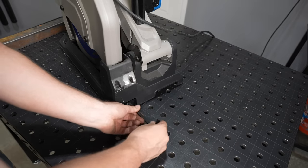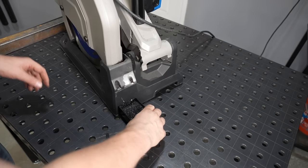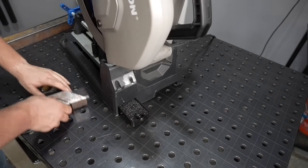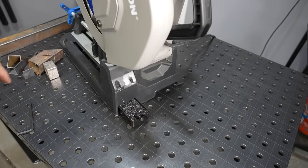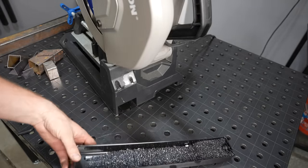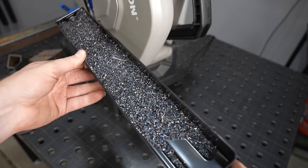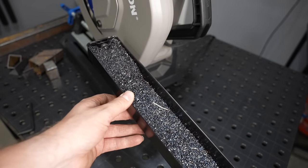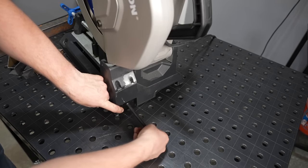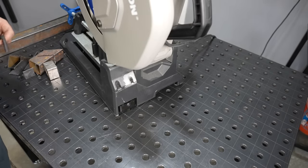Let me slide out that tray — I use the allen key to loosen the latch, and it's spring-loaded to pop out a little bit. I need to raise the blade up to get it the rest of the way. In my experience, this tray fills up really fast — you remove quite a bit of material and have to empty it often. There is still some sweeping to do on the floor, but all those chips that are caught are the ones that would otherwise be underneath the saw. If you have it set up in a station, it's really nice to clean out without moving the saw. It's a good feature, but it doesn't eliminate cleanup entirely.